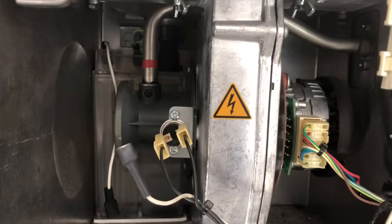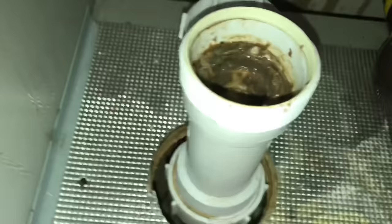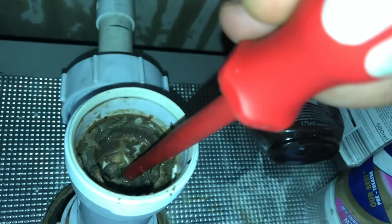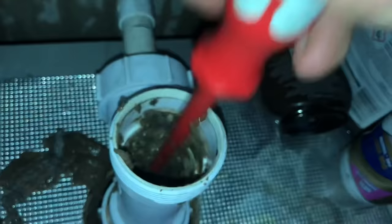The condense trap is completely full. When it becomes blocked and fills up too much, it's a safety cutout that stops the boiler from lighting — because if the boiler fires up when the condense trap is blocked, it'll produce more condensate with nowhere to go, backing up and flooding the boiler. Following the condense pipe under the sink, you'll find this on a lot of new builds: they take the condense pipe internally, which combats freezing on the outside, but when it goes into a kitchen sink, scum and soap can cause it to block. It's only a 20mm pipe.